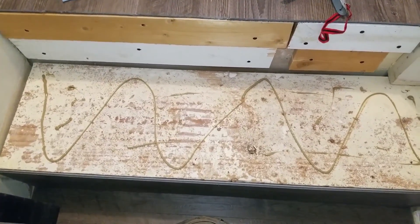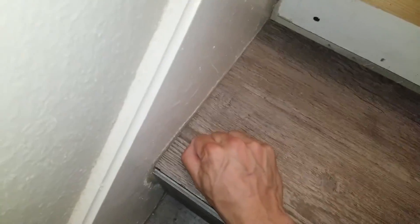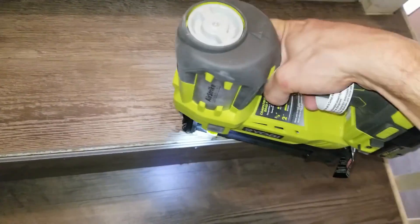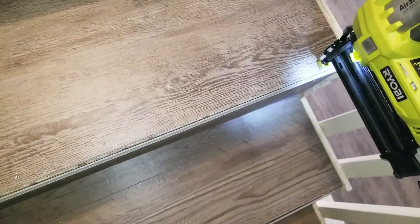I can't show this one-handed, so I'm going to install it real quick. It's still overhanging slightly, so now I'm just going to push it back. Right here I have a little cutout — got to be careful. Sliding it on the glue, I'm just going to press it flat everywhere and make sure the glue makes good contact. Next, I'm going to put some brad nails in. This is just to really hold it down in case the adhesive fails in 10 years so it won't just fall out. I'm going to do it right here — this is going to be covered up anyway, so I'm not too worried about it damaging it.